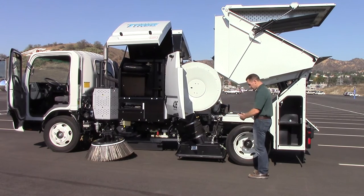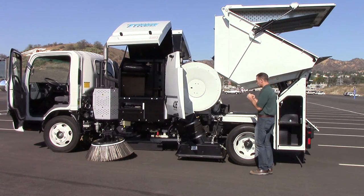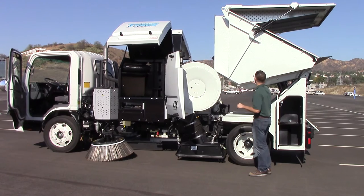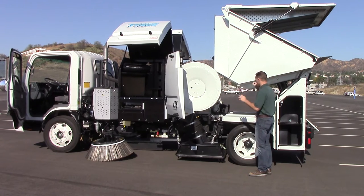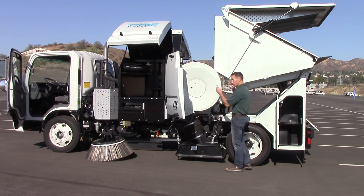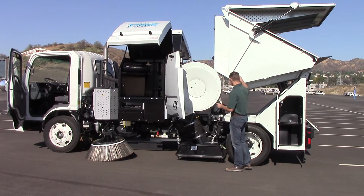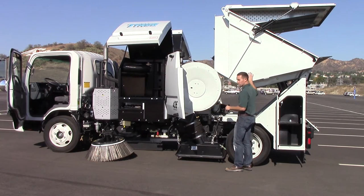When it's sealed on the ground, you're air blasting the pavement — getting all the stuff out of the nooks and crannies and cracks, even big three-quarter-inch rock, getting them up into the air. We call it a regenerative air system because when everything is closed, it's a closed loop. We don't pull any air from the atmosphere, and we don't give off any air to the atmosphere. We're pressurizing the head, air blasting the pavement, and because it's a closed system, anything this blows, it has to suck air from somewhere — from what we call our suction tube. Anything this blows, it automatically sucks up that tube and deposits it into the hopper.